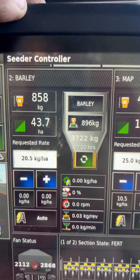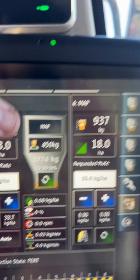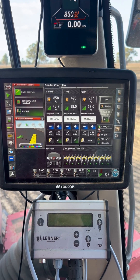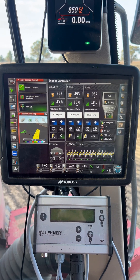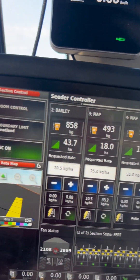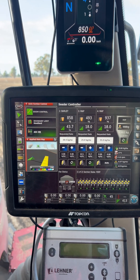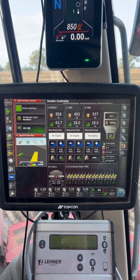You can see this one's tracking about 40 kilos difference, but it's not enough to be about 5% difference, so it's going out a little bit light. If it doesn't come up with an error saying your calibration factor could be incorrect, and it's within 5%, it's probably okay. But it's going to take at least a couple of hectares for it to figure that out, so take that into account when you get going and suddenly get a bunch of orange boxes pop up at the top. Address one at a time, go through the steps — how much is the percentage difference, how much should I change it? Don't be afraid to take bigger steps, but work in that 0.01 to 0.001 range for your adjustments.